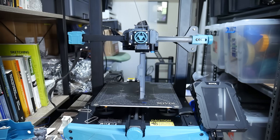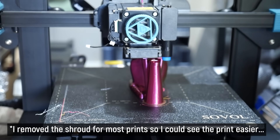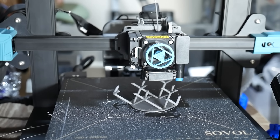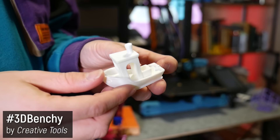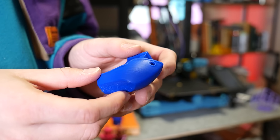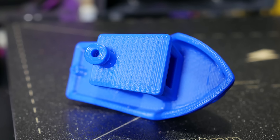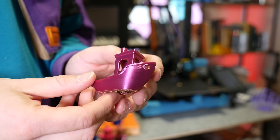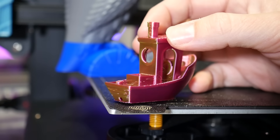For my test prints, I played a lot with maxing out print speed while maintaining the best print quality. Cooling was still the major bottleneck, requiring layer speed slowdowns on delicate parts. Starting with that 25-minute Benchy in blue PLA+, the result was stunning — an incredibly good Benchy at 0.2mm layer heights. The top infill filled in properly, the sides of the hull look good, and even the little chimney at the top looks very clean, which is a testament to that huge curtain blower fan. I also tried a two-tone shiny filament and again it looks really, really good.